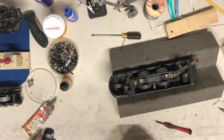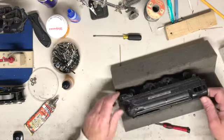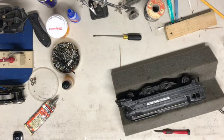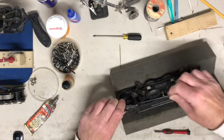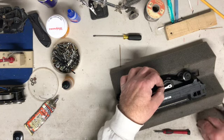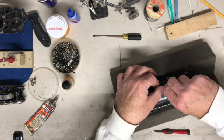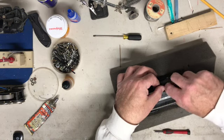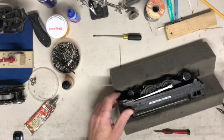So I'll be right back. Give me a minute. I'm going to swing over to the bench grinder and take off this sharp edge. Okay, I'm back. And let's see here. So I dropped the rod. Okay, so here we are. I took a little bit off, rounded it, made it smoother. So we're going to put it back down in here, turn this sideways, get it back on here, and get the little hex-headed screw on there that holds it. Again, we don't want to cross thread it. There we go. Much better. Okay, so I'm just going to snug this up over there.